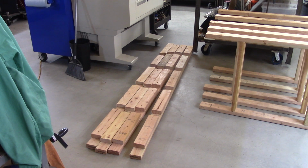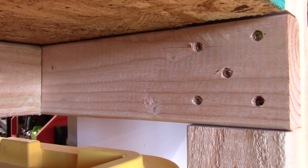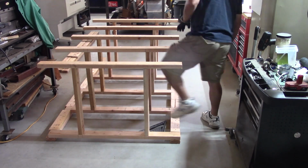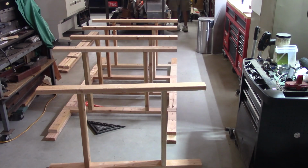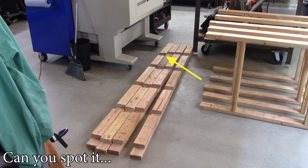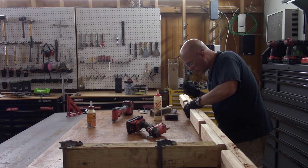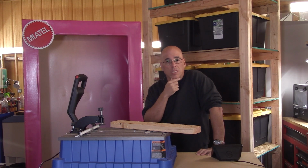Now all we have to do is assemble it all into place and screw the shelves into the legs. I use 5 screws per section. If you did everything right, you will end up with 4 legs just going in and aligning itself as intended. You may need to hammer the structure a little bit here and there in order to make it square, but for the most part this is a pretty straightforward step. Unless you made the silly mistake of mixing 2 wooden support spacers and now the darn thing will not budge. Man, I tell you, it happened to me with 1 leg, and the problem is that I had allowed the glue to cure overnight, so allow me to say that is how I learned how freaking strong this glue is.